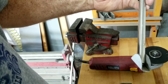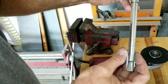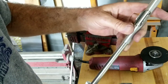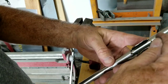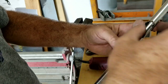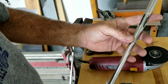So then I'm going to make this little latch here. This thing slides inside the other like so - there'll be a hole drilled right about here, and you'll be able to push on this lever. The lever will go from about here to about there, like on the original one, and you push here and there'll be a little spring underneath to hold it from coming up. I'll cut two angles and then bend that piece straight up so the spring will stay on there and then the thing slides in. I just have to make the handle first.